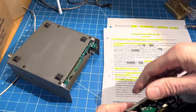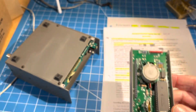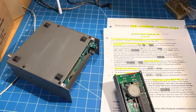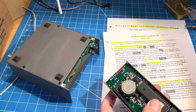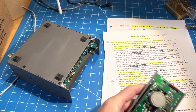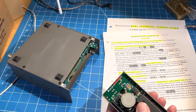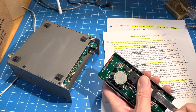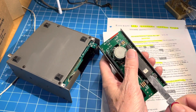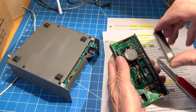There's the chip we need to replace. We can zoom in the old-fashioned way, and you can see that's Rev. 106, so that agrees with what we found on the front panel. I should use something grounded and have a little screwdriver out, but I'm going to try the flat blade of a pocket knife and give it a little twist — up there and here. You can hear it letting go slightly. There we go — no pins bent, so that's good. We'll take that and stick it up on a piece of anti-static.